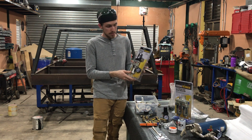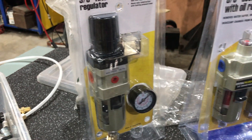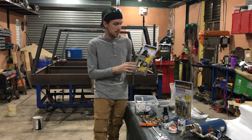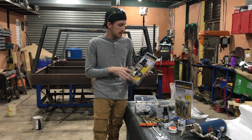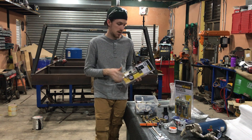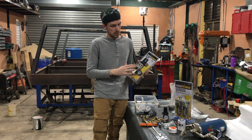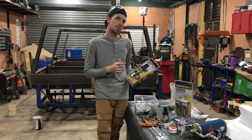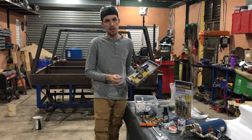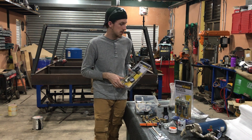You've possibly seen one of these — a brass filter with a swirl system inside that causes the air to swirl around a special brass filter material, making moisture in the air condense and collect at the bottom, which you can empty very easily. This one has a regulator, which is convenient for setting up a separate workstation. But these will eventually get an oil film built up and may stop filtering well and collecting water. You can take them apart and clean them with Dawn dish soap, which I'll show at the end.